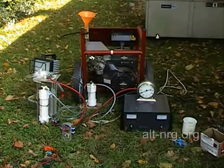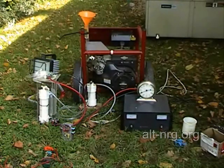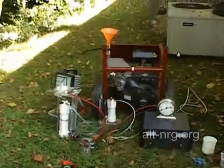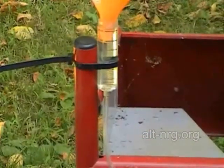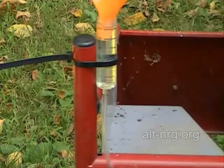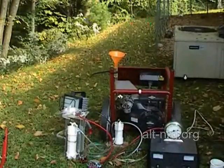What you see in front of you is a Wheel Horse 11-horsepower, 5,500-watt continuous, 8,500-watt peak AC generator with the gas tank removed. That is a 30-milliliter syringe with graduated marks to measure gasoline consumption from the engine in very small increments and very accurately. I'll take the camera off the tripod and bring you closer to show you the experiment.